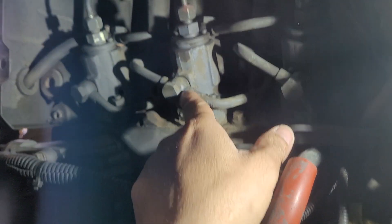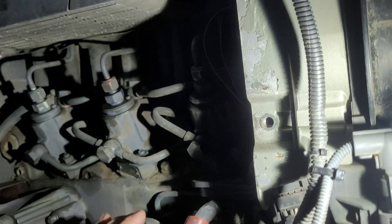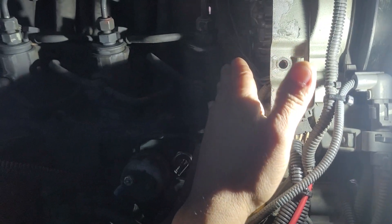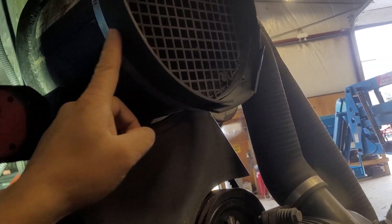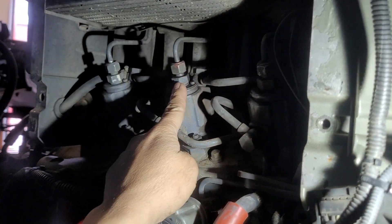We're going to change number two. This is a front engine and three-cylinder, but this is an awkward cylinder number. Here, this is number one, two, and three. If you are facing the front of the engine, this is number three cylinder or number three injector - that's at the back. So facing the front: one, two, three. This is an air-cooled engine - no radiator, no coolant, just air-cooled, driven by belt only. So if you're facing the motor, the first injector is number three, two, one.